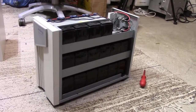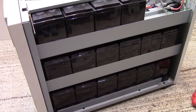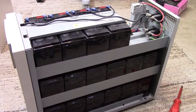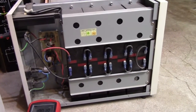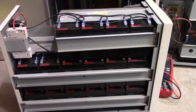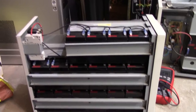And it truly puts these swollen APC batteries to shame, because this unit has, for some reason, entirely ruined all 16 of these batteries, and it has not done so very safely at all. These batteries have clearly suffered some form of failure and have been continuously overcharged, and the unit never understood that. In the internal battery pack, eight of the same battery style, we have one battery with a shorted cell. And in the other external pack, which isn't entirely ruined, we have three batteries with shorted cells. And the unit doesn't seem to be able to grasp that — it's just kept on charging and charging and charging.